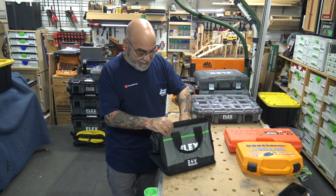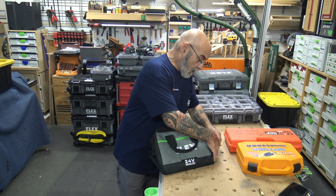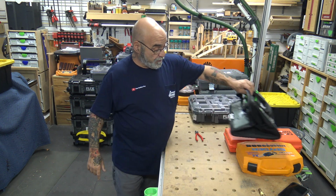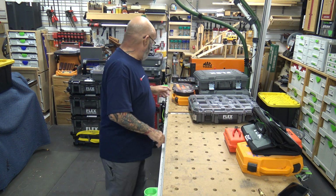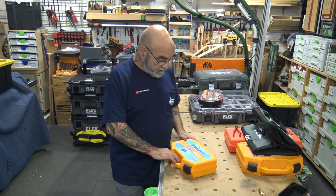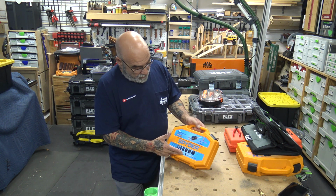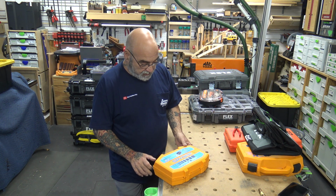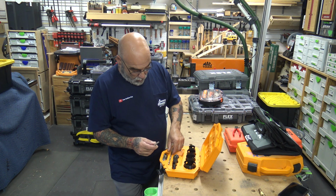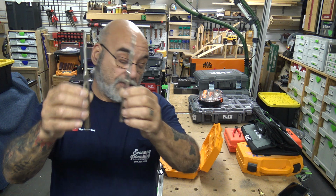I had to put an outdoor light in. But this thing went right through hardy board and wood. And I had to open the hole up more for a piece of electrical conduit to go through it. But I bought this set of spider bits. These are like hole saw bits, for metal, and they work pretty much the same. This I could tell you was $49.95. So they give you two arbors, but one, again, is a little bigger than the other for the larger bits.